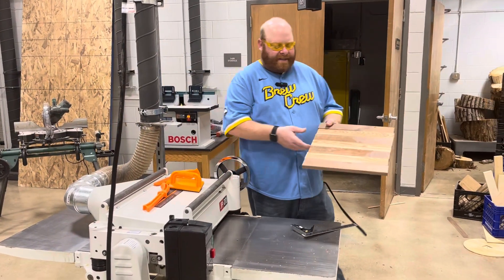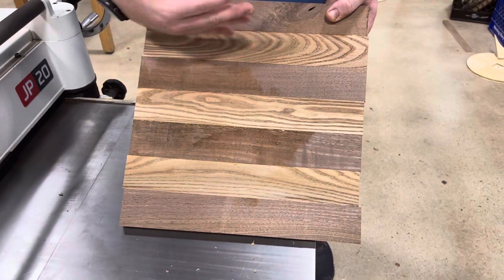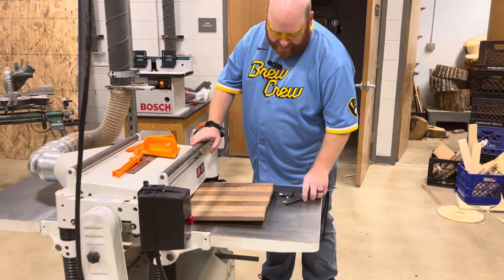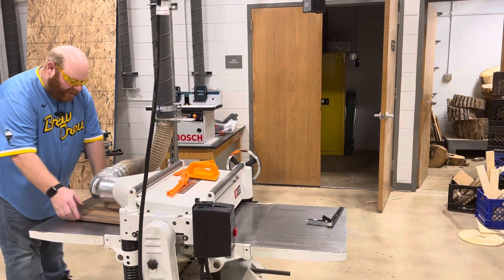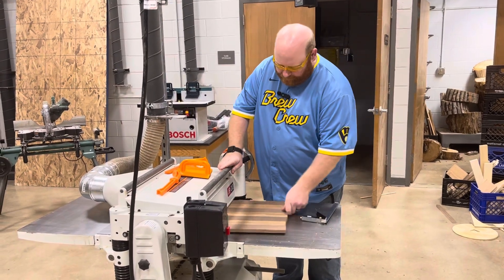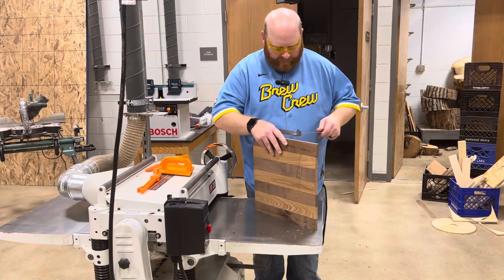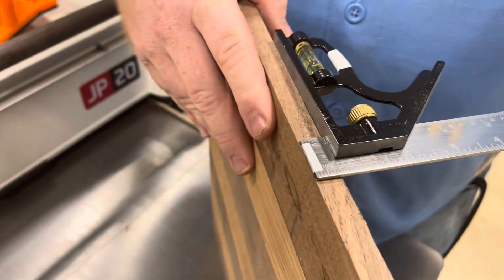It's really not part of the training but I'll show you this anyways because a lot of kids do it. We glued these pieces together and we made sure there wasn't a ton of glue sticking out, otherwise it gets stuck in there and you start to get burn marks on the wood. So you can see we didn't have a lot on there as we started so it shouldn't make a big mess. You can hear it cutting away — we're almost there. Now you can see that the wood is right where it needs to be. It's flush, so we've hit our half inch.